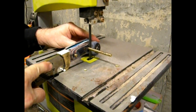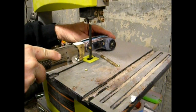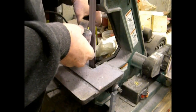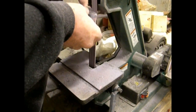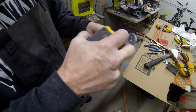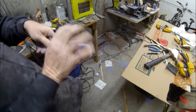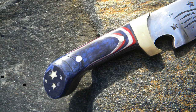In order to finish shaping the micarta handles, you can use the belt sanders. I also used a Dremel grinder — it works really well. Once you've got it shaped, you do have to polish the micarta if you want that smooth, shiny look. I went to a sander at 80 and 220, then went by hand — doing the exact same process as the blade: 400, 800, and then 1500 grit emery, which is what really brought it to its final polish.